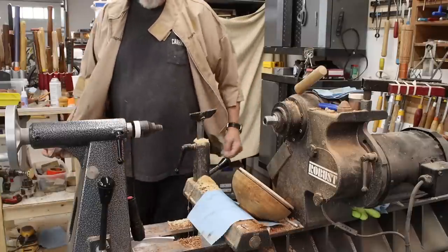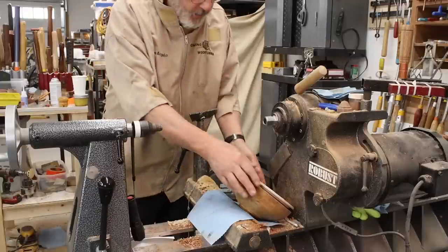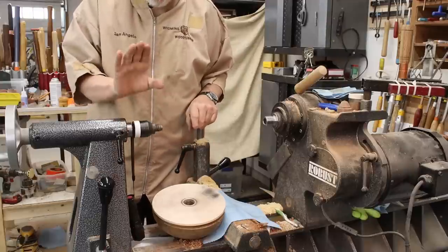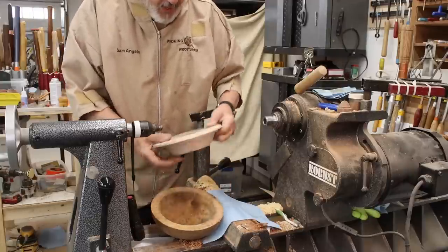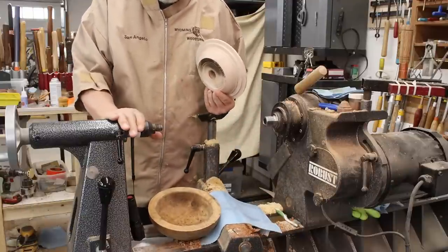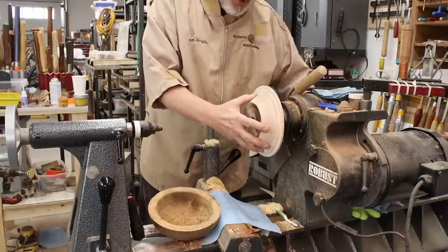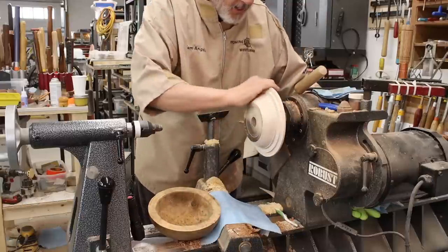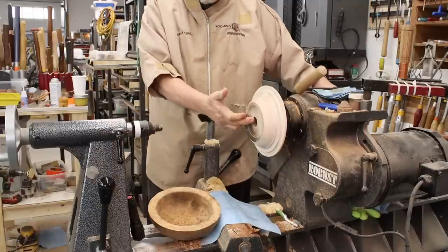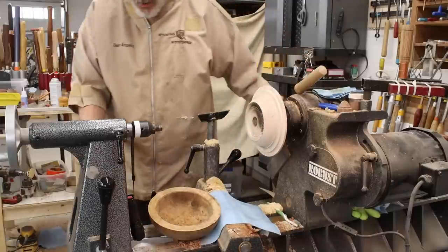All right, now sometimes we all have our own terminology. For me, a friction drive uses the tailstock, the tail center, as support. If we have a jam chuck, well, I believe you don't have the tailstock support. That piece is jammed on, and that's all it holds, that particular piece of wood. Now, I've got this block of wood threaded. It takes a tap, and if I can find that, I'll show it to you.